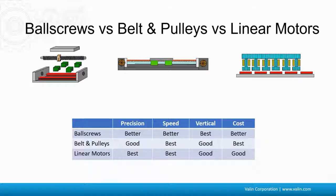Now, a brake on a linear motor is difficult — possible, but difficult — so perhaps we put a counterbalance on there instead. He also mentioned the backdriving. Linear motors, if he had done that backdriving with a linear motor, they would have been really easy to move. The belt-and-pulleys have some friction, so they were not super easy to move around. The ball screws are still backdrivable, but very difficult usually to do by hand, unless they're under a high load — you really have to push against them. He may or may not have been able to do that by hand, depending upon the pitch of the screws.